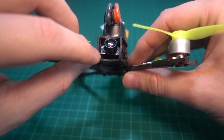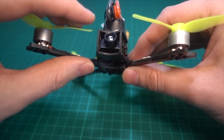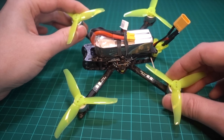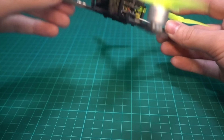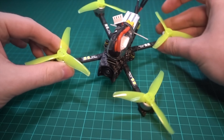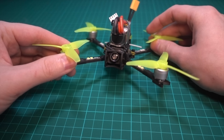The camera looks like it's in a 3D printed housing, so it's probably a board camera with a 3D printed enclosure. This is a 3-inch quad and the frame is a true X, meaning motor to motor it's symmetrical. The frame thickness is 2.5 millimeters carbon fiber. I always like to do a bend test and it seems fine on that front. The motors aren't the prettiest — they remind me of the original Baby Hawk motors from Emax.